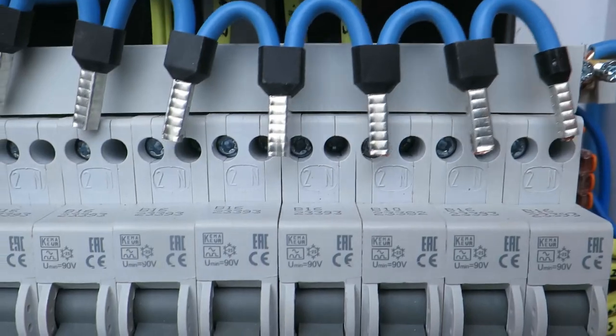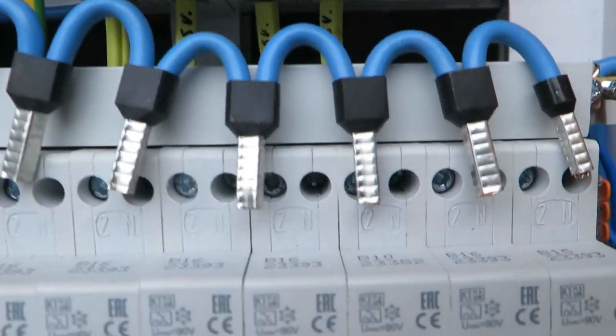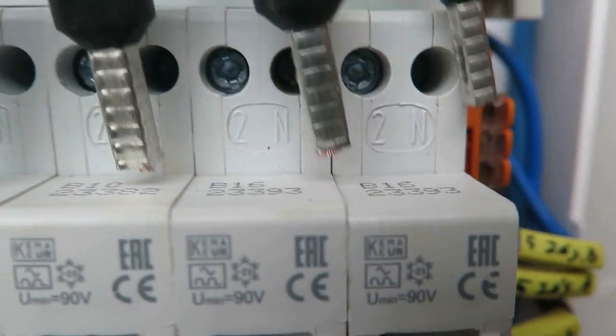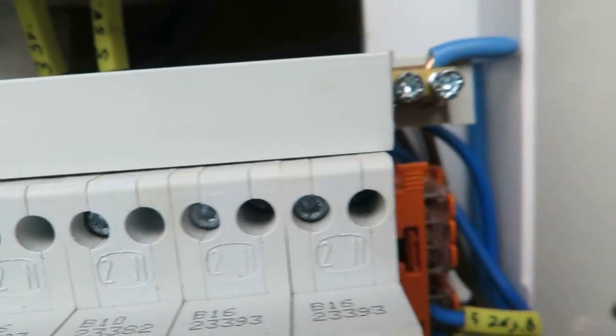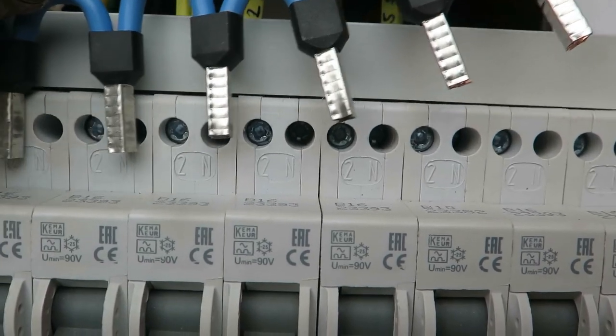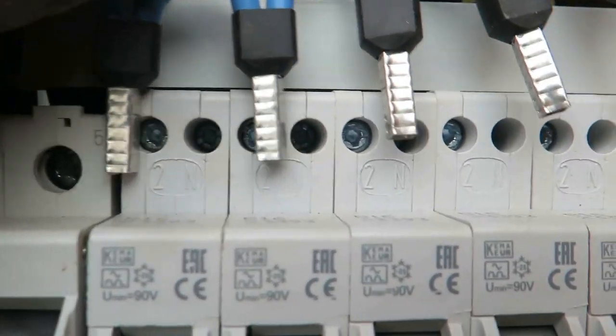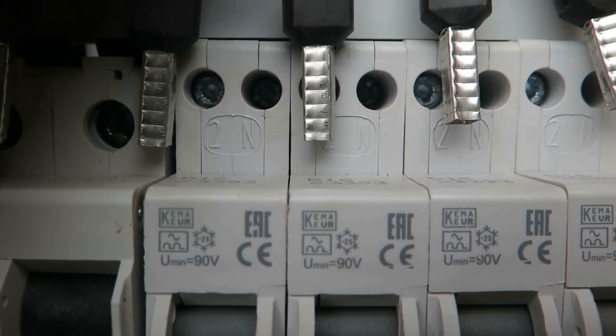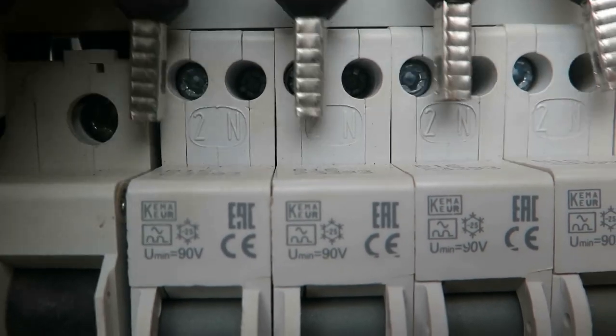My only problem is, I have many problems with this solution. A, it looks ugly as hell. B, it is chunky. Like, okay, let's say I use this thing and I put it here like so. It is much higher than the bus bar itself. And C, if you fasten these screws to the 2.5 Newton meters that are prescribed or recommended, there is a good chance you won't get it out, because, can I show you kind of an orthographic view? Yeah, these are as wide as the terminals itself. So if you deform this, there is no chance you will get it out.